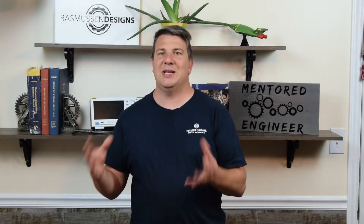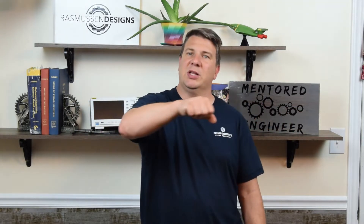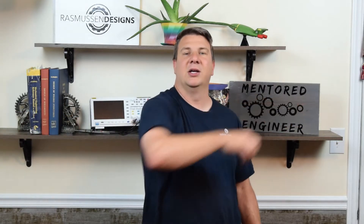Cool things can be done with LSM. The last part of the name is 'synchronous' — what does that mean? Without boring you with the technical definition, we're going to put out a specific sine wave pattern and control the exact positioning of that. We can accelerate up to a certain speed, hold that speed, then decelerate. So if we were shuttling something from here to there, we could accelerate quickly, hold a constant velocity, then decelerate — and we can do that using synchronous technology.